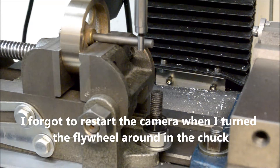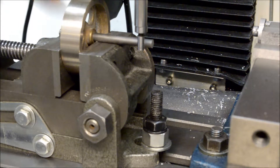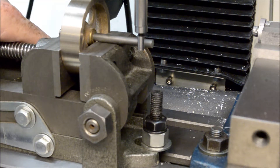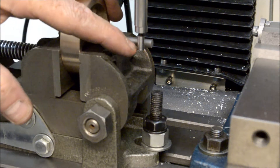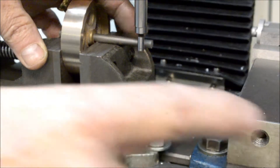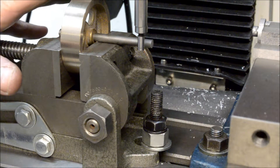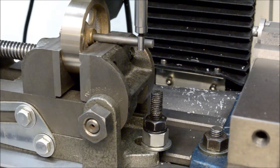So we've got to drill a hole at an angle to put the set screw. What I did was get my angle vise bolted down to my milling table. I put the crankshaft in and I'm going to pick up the center of this crankshaft. Then I can move my table in the X direction and tilt the vise to the angle I need to drill and clear a hole for that. Let's get rolling.